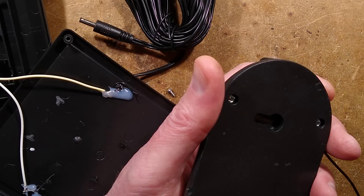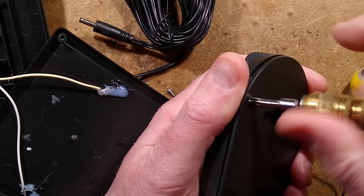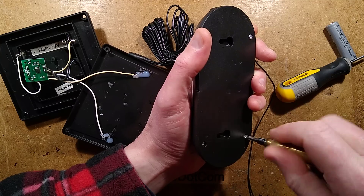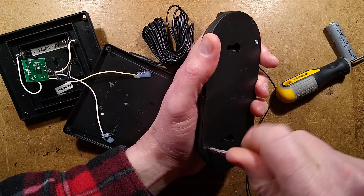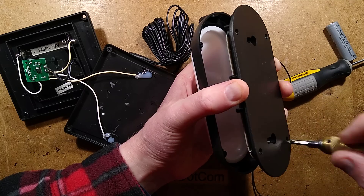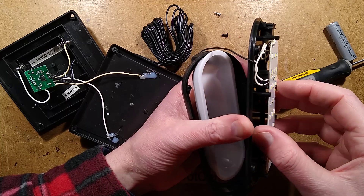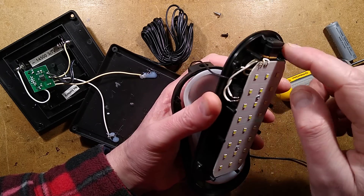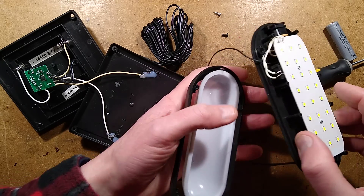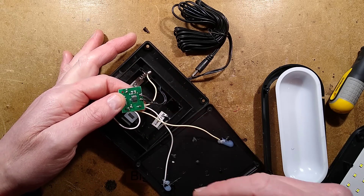I'll take a look at that circuit board. Let's pop this open and see what's inside. So is this just going to be the LEDs, but are there going to be resistors as well? Is it going to be something sophisticated or just a panel of LEDs - maybe just one or two LEDs? We have a huge sneaking parallel array of LEDs. There's a little pull cord switch and a power jack. That is it - all the circuitry is in that unit there. I wonder if that resistor is the series resistor for these. I shall take the circuit board out, take a picture of it, and we can reverse engineer it and see how this works.